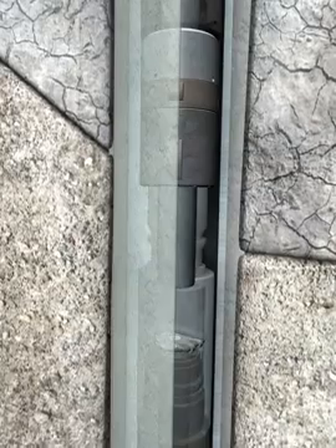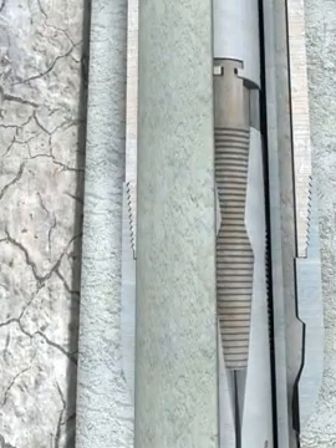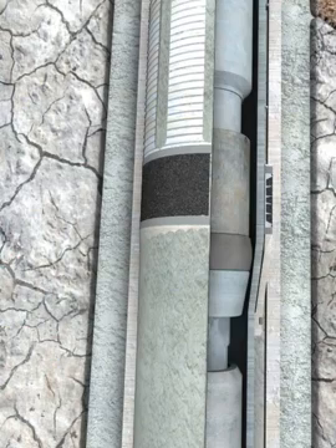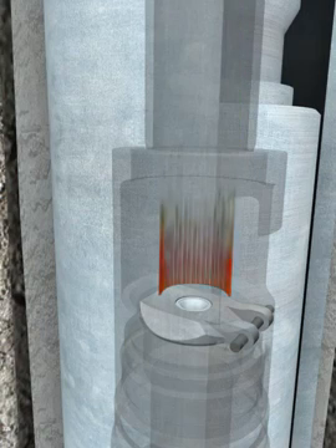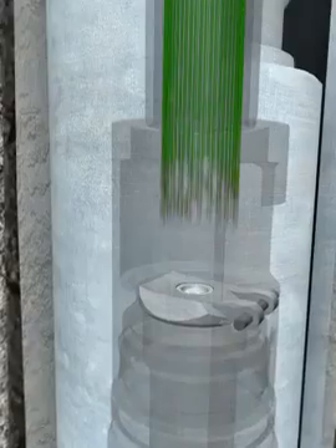Additional downward travel releases the curved flapper to a closed position. The closed flapper creates a seal internal to the running tool. Applied pressure on the flapper will once again engage the hydraulically operated anchor slips on the running tool into the internal diameter of the liner. Additional pressure against the flapper drives the swage, expanding the packer body and energizing the ZX seal against the casing. After the annular packer seal is fully expanded, additional pressure ruptures the disc located in the face of the flapper, allowing pressure to bleed off, releasing the anchor and providing circulating capabilities.